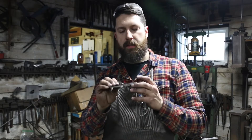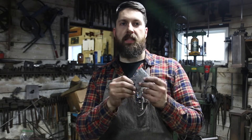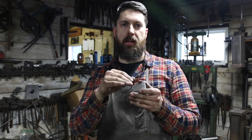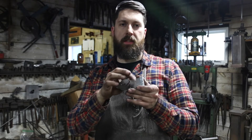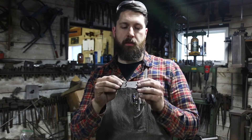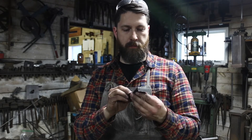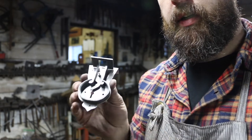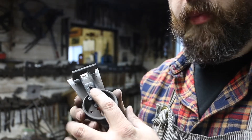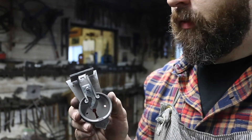It's been a little while since I've made one of these, and when I was trying to test fit the lower tumbler I realized that the pin I put in earlier for them to go through wasn't correct. I just had it flush, but it actually needs to be longer and have a tenon on the top for when the cover plate goes on, to get the cover plate to be riveted on. So I went ahead and popped out that pin and I'm making a new one now. The post here needs to have a tenon on the top.